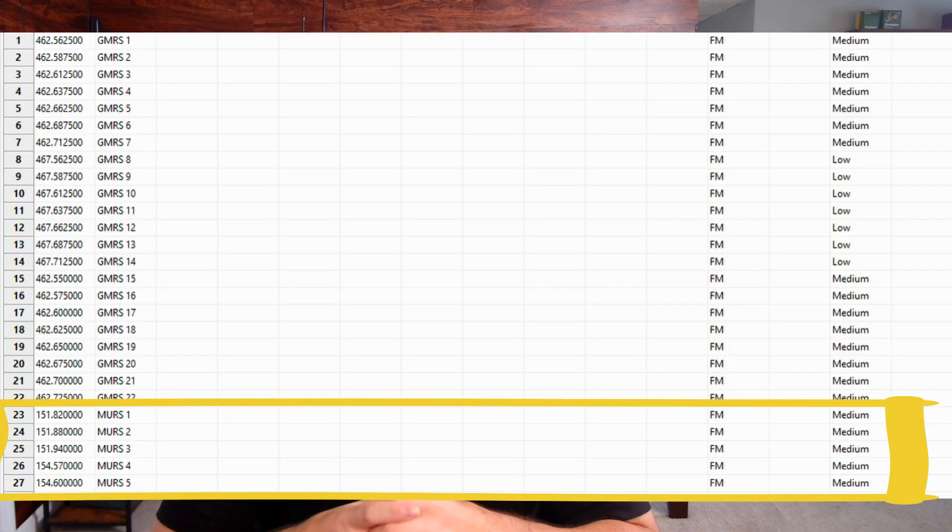For prepping purposes, even if I don't have my ham license, I want to be able to at least transmit on ham in a real emergency — not like you lost your dog hiking and you have a cell phone. It's got to be life or death. If there's ever some kind of societal collapse, you want your radio to access everything. Another big reason to get a ham radio: there are five VHF license-free channels called MURS, and if you buy a GMRS radio you can't access MURS — it only transmits on GMRS frequencies. You get five more channels with a ham radio.